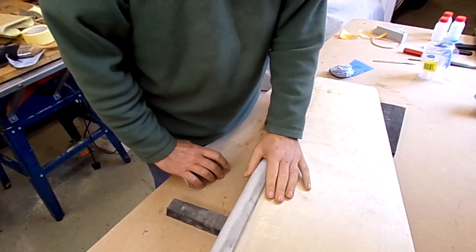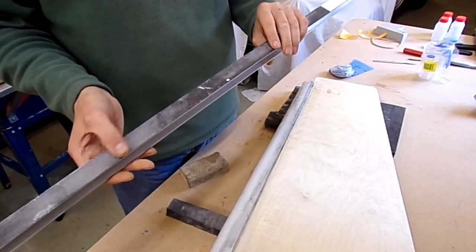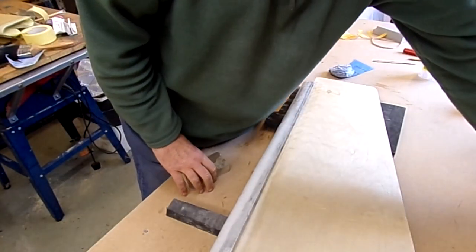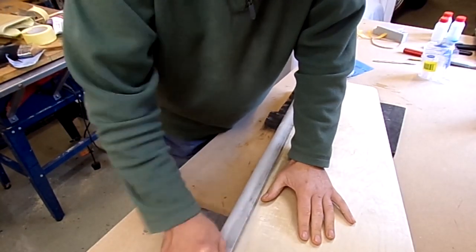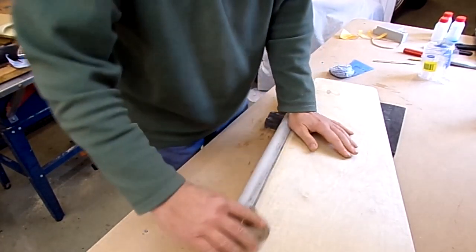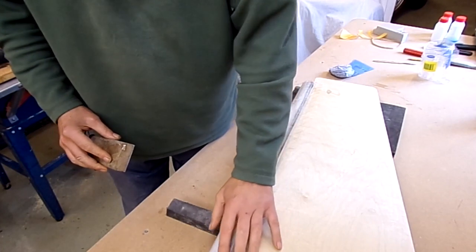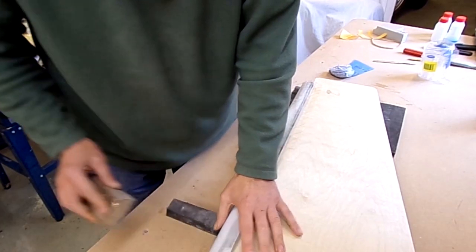I've already gone along and taken off the worst of it with the long board, using the 180 grit on the long board to just get the shape sort of feathered in. And now it's just a case of feathering in the edges here with, as I said, the 400 grit, and hopefully we end up with a nice smooth transition, and we should be able to get on to do some varnishing.